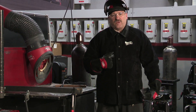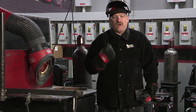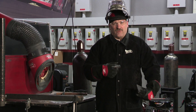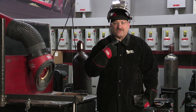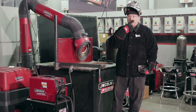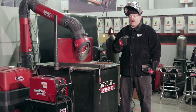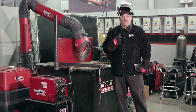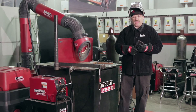Always important to work safe. Today I'm going to be wearing an all-leather jacket because I'm going to be welding overhead, and what goes up must come down. There's going to be some hot metal falling down, so I want to be protected. I have leather gauntlet gloves. I have on some cheater glasses — these are redline glasses and they're ANSI approved safety glasses, but they also have a diopter 250 for an old guy like me. I also have a cheater in my hood for when I'm welding. These cheaters here are more for looking at my weld afterwards. It's important to inspect the weld when I get done making my first pass, make sure I get all the slag out before I put the second pass in.